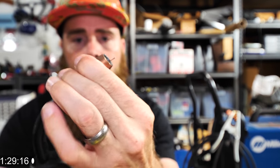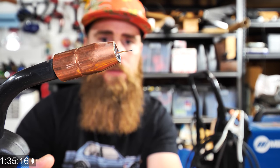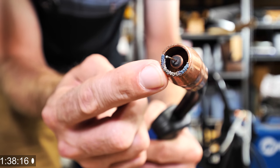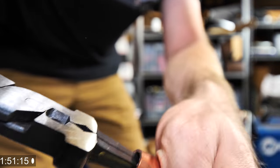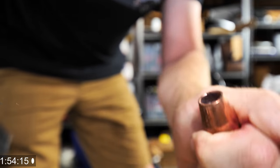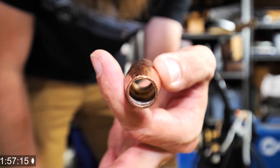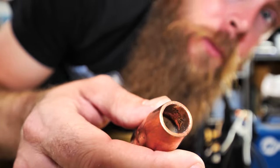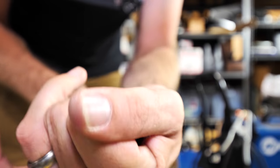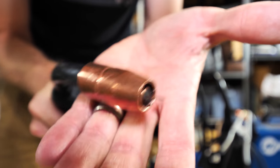You can clip that down so that you have the proper amount sticking out of the nozzle right here, and then your weld's gonna look beautiful. For the last thing — I have a little bit of slag in here right inside the nozzle. You can use the tips of these right here after using the back. You can pull that off, clean up the tip just by going like this. That cleans up the end of the nozzle so that you can have proper gas flow — you're not gonna have anything clogging it up. Having a nice clean weld and having cleanly prepped tools is going to help you out so that you can have a nice steady stream of gas, nothing blocking it when it's coming out.